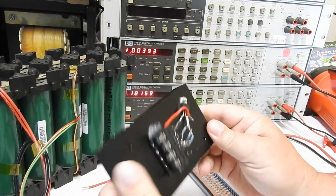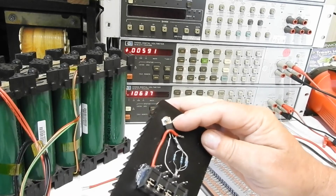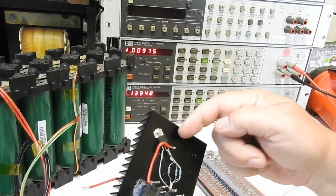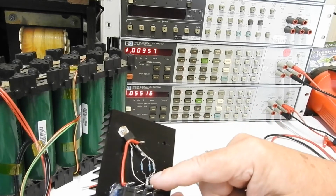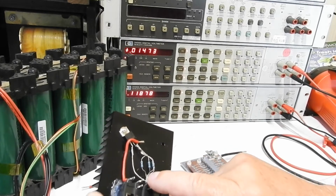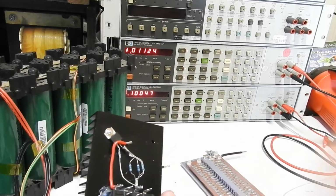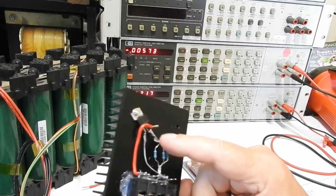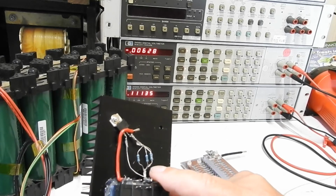I just made this simple, just a heatsink with an LM317 adjustable voltage regulator with a resistor on its output connected to its adjustment input. So you put the volts in here on the input of the regulator, out through the resistors together with the adjustment, and you connect a load there to the negative side of the supply, and you'll get a constant current depending on what these resistors are. I've got 4 of them not only to get the right resistance but also to spread the load, because they're carrying the full current. So you don't want to dissipate too much power in any one resistor.